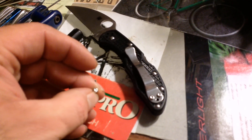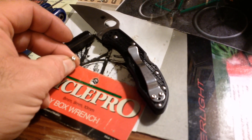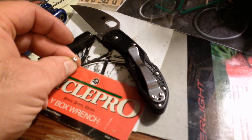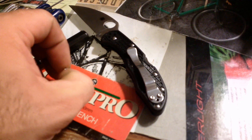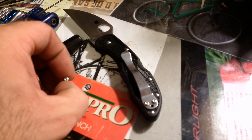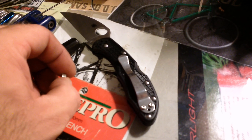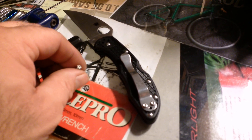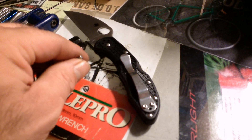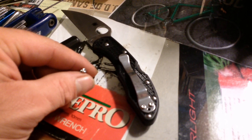The reason for that is the other one's here — you can sort of see it there — there's a slit across the top. What happened is these have what's called a Torx head. It's a little star-shaped thing, and the Torx screwdriver I was using had a worn-down end that didn't engage properly, and it started to strip the inside of the star-shaped opening. So this was rounded out and I actually couldn't get it out.